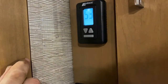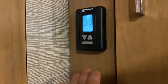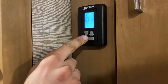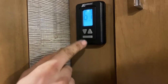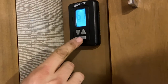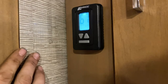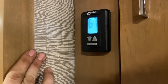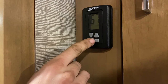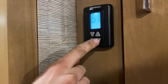Set it to cool and turn down to a temperature cooler than what it is — the compressor will kick on, even flashing words saying it's communicating to the air conditioner. Cool high or cool low runs the fan constantly at that speed. Cool auto low or cool auto high will cycle the fan — turn it off when it reaches temperature, turn it back on when it needs to cool again. Kind of a power saver.